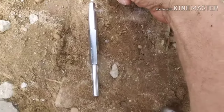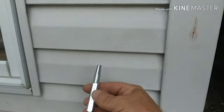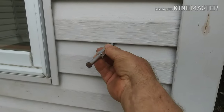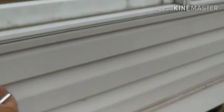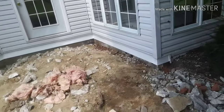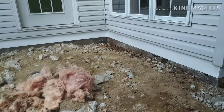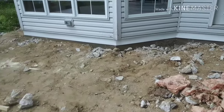I've got this nifty little tool here that holds these tiny little trim nails for you — because I've got these big sausage fingers. You can probably use pliers, but this thing is nice: just stick a nail in there, hold it up wherever you need to go, and it holds the nail so you can punch it with a hammer and drive them in without smashing your fingers. It works out pretty well, especially under the window where it was kind of flopping around. After I got all the flashing on, I went around and caulked everything — the corners, seams, nails, and up under the vinyl J channel.